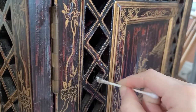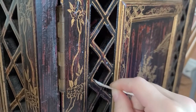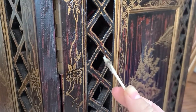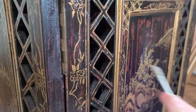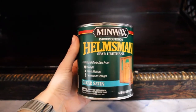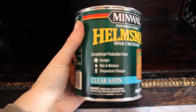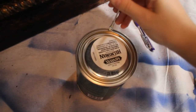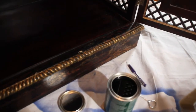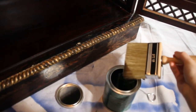After cleaning the cabinet, the next most important step was waterproofing. I needed to make sure that this cabinet was really thoroughly protected from any potential water damage given its purpose as a sink vanity. I chose a polyurethane used for bar tops and outdoor chairs, so this one was pretty heavy duty, and I gave it multiple coats. I decided to do one coat early on and then more coats after I had drilled the holes — this was just my initial first coat, letting it dry thoroughly before doing any more work.